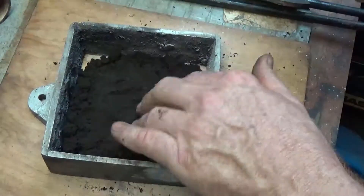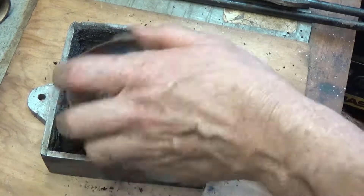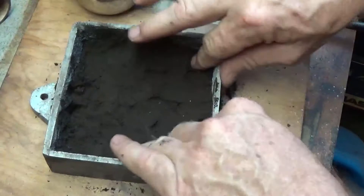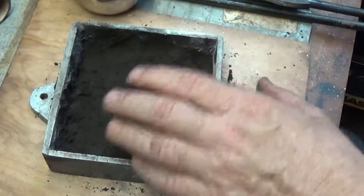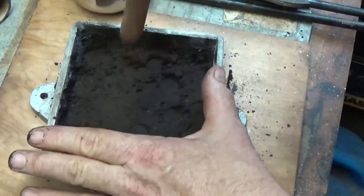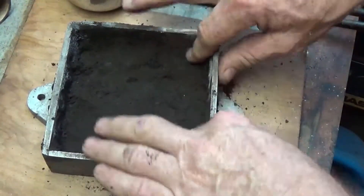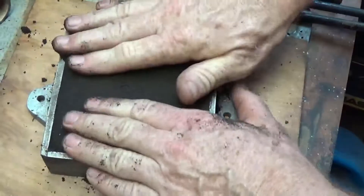From here I'm just going to start dumping my sand in. I don't really care whether I have any pieces of metal left from the last pour because it's not going to touch the pattern. I have this on a board to keep everything nice and level. I'll start using some tools to ram this. You really can't get it hard enough — the whole idea is to pack this as tight as you can, because you don't want things shifting and you certainly don't want it to fall whenever you turn it over. So there's the finished ram, at least on the bottom part.